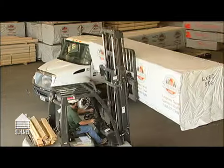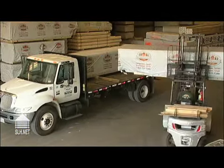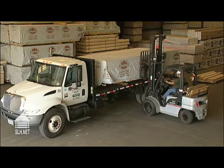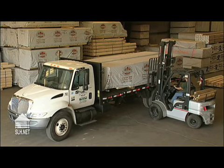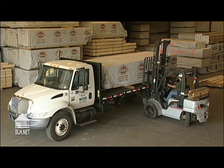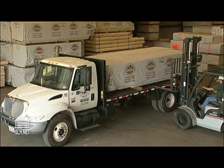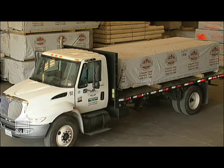You want to buy a dry log because wood is not a perfect building material. It's going to constantly move. It's going to take on the moisture in the air. It's going to expand, it's going to shrink, it's going to move, it's going to split, it's going to check. And the only way that you could be assured that you're going to get a stable piece of wood is to buy something that's dry.